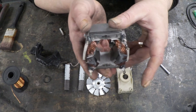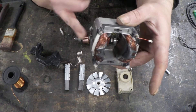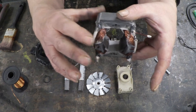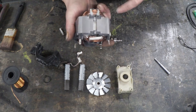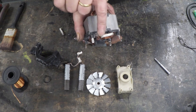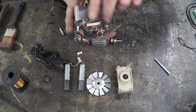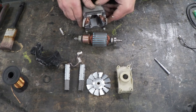Even if it's two coils on the field coils, it's really worth repairing. This one isn't meant to be repaired, but very often — particularly in starter motors — the shoes in here have a screw on them. You can take the screw out and that whole coil comes out as one piece, so it's often well worth repairing them. I found my break, and I checked it was the only break by checking resistance between all the terminal combinations. I get continuous resistance between those pairs but not between one pair — so that's my break. All I have to do is solder a piece in there and reassemble, and I'll have a working motor.